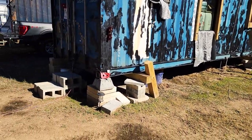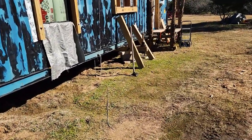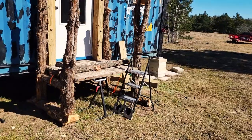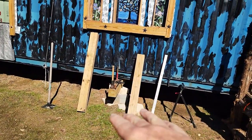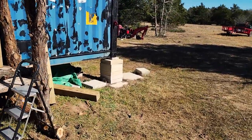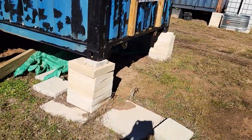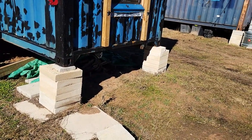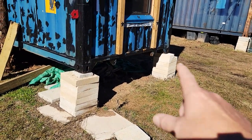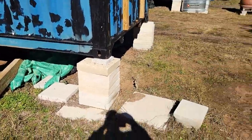The first thing is, on your Conex, you can honestly get by just supporting the end post. You'll see that it's just the end post that I am doing the load on. In the middle, as I get the load, I won't want a bouncy house, and I'm going to do earth bag and reinforce that up so there's some security there. That's my first tip — don't be afraid to raise these things up off the ground. You can do that and then get in and service them. I went up two feet and used blocks for now. Eventually I'll put in barrels, fill them with concrete, and that's how I'll work with that.